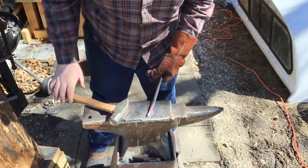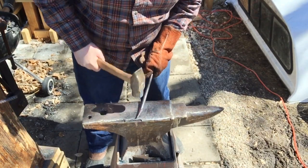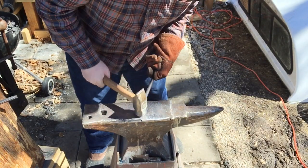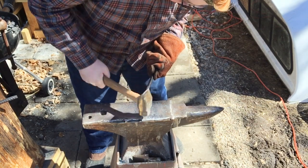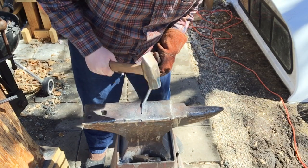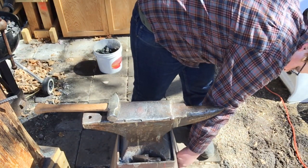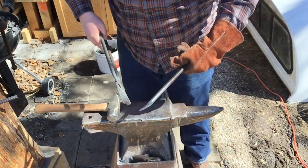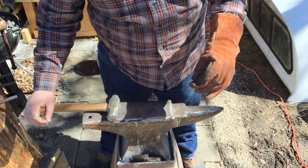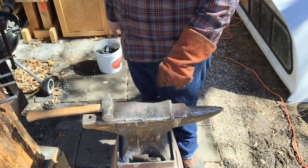It's probably like a 3/8 inch round bar and I'm bringing it super thin so I can just take my pliers and bend it into shape. I'm using quite a short bar, so I am periodically dipping this end into water because the heat does go to the back. My goal is to draw out a really long, super narrow taper — not even really a taper, just to draw it out — and it's great practice, so that's kind of why I'm doing it.